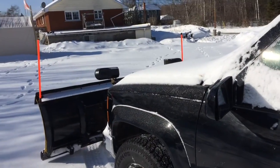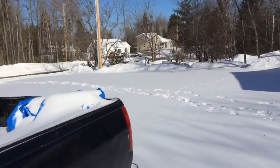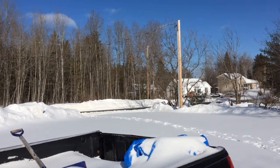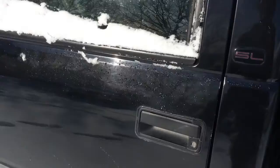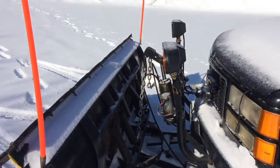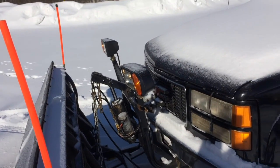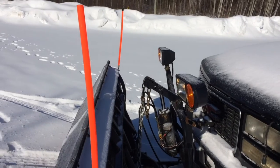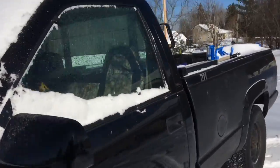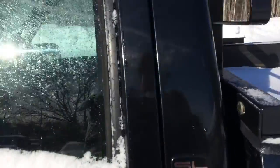So this has been asked by many people — make a video on this old Myers plow, a demonstrational video for you guys here today. Got a little bit of freezing ice pellets the night before so the whole yard needs to be cleaned up. I parked the plow facing the Sun so that the plow pump will actually kind of warm up. I have a bit of a problem when it's really cold outside — the plow pump is sometimes really sluggish, so I just kind of park it in the Sun to allow the fluid to warm up.